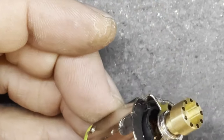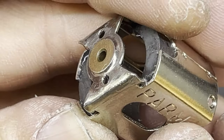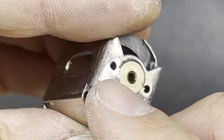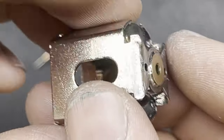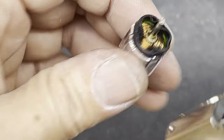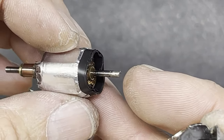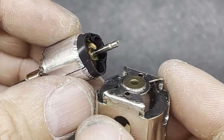I'll take the end off and have a closer look. I've removed the armature and the end bell and just given it a wipe with a cloth. You can see that the solder joint runs nicely around the whole of the bushing and holds it in place nicely. I'm going to give that a little wash under the tap to make sure all the acid flux is gone. I'm also going to give the armature a bit of a wipe, take the tape off, and give it a quick wash around the end to make sure no acid flux got onto the armature. Then we're ready for further assembly.